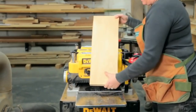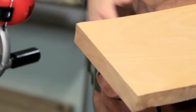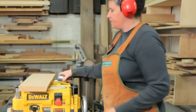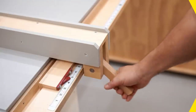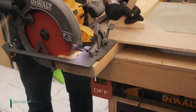There should be ratchets within the planer so that if the rollers lose their grip on the stock, it won't kick back out of the machine. Check whether the surface planer you're considering has a dust vacuum, because the amount of sawdust produced by these machines is substantial. Always use hearing protection when using a surface planer, as these are among the loudest tools in your workshop and can cause hearing damage. Safety glasses are also advised for all power equipment.